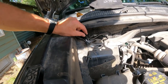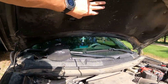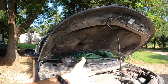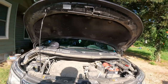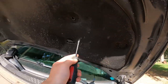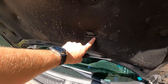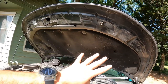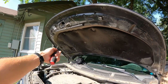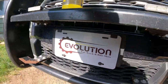I believe this one is going to be done — this one goes to the back, and this one here leads up to the hood. So we're going to go ahead and remove this fire damper. If there's an engine fire it drops down and is supposed to help suffocate it and put it out. I've got a little screwdriver and I'm starting to pry these tabs out — there are eight of them and then two little hooks. When we get those out it'll pull straight up and out, revealing our line so we can make sure those lines are clear as well as cleaning the tips of the sprayers.